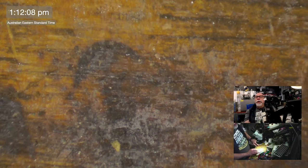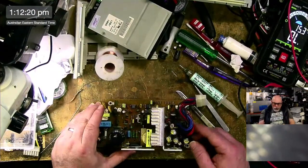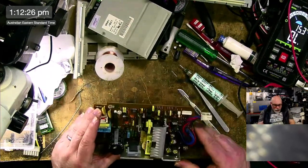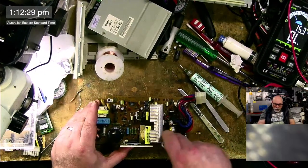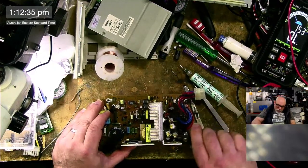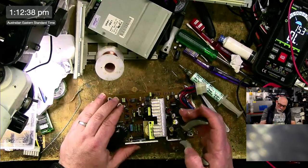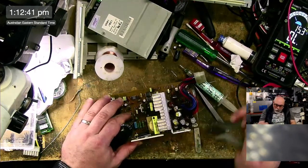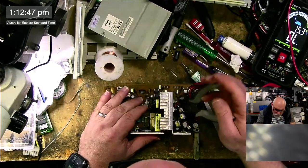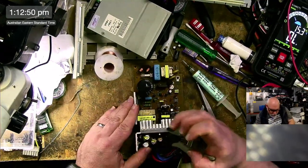Okay, so I've really only got one more thing here to do, and I may not even finish it, we'll just see. And that is I want to pluck off a few components on this. This is an LC630 power supply, and I need to replace all of these capacitors here. And I've got to actually order these two, I don't have these two. And we've got some of this snotty stuff on it, holding these in place, and I want to remove it because I want to remove these capacitors one at a time, not as one big clump. There we go. Look at that. Snot.